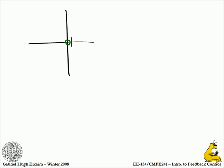And so I say, well, okay, I'm going to solve the DC gain problem by moving my 0 off of the origin. It's still close to a derivative, but it acts less and less as a derivative at DC and becomes more and more of a derivative as I go to high frequency. Because when I'm evaluating this way away from here, the difference between it being on the origin and slightly off the origin is pretty minuscule. So at high frequency, this acts like a pure derivative. At low frequency, it does not. So it allows some DC to pass, which is good.